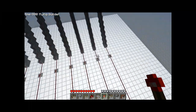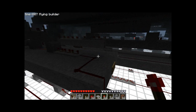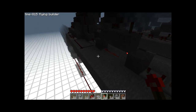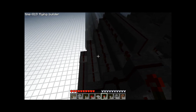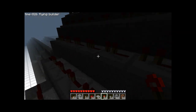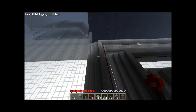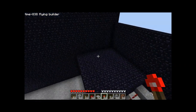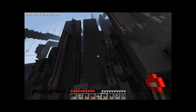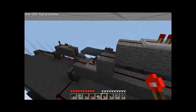So if Z is on it'll be turned on and sent down in the same order that you pressed the button. Once released, the signals go down here — A starts down there all the way through to Z. They come down and go to what I call display drivers, which decode each pulse and split it up into the five different levels for the display. It then travels all the way down to the display. These are all the letter decoders — I'll make another tutorial for how to make each individual letter.